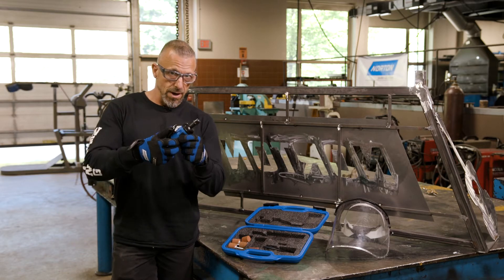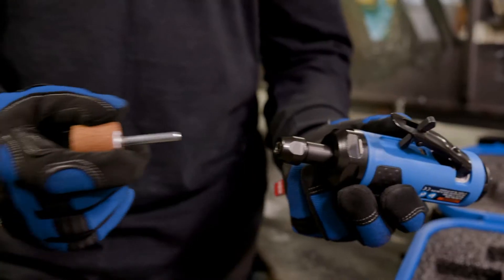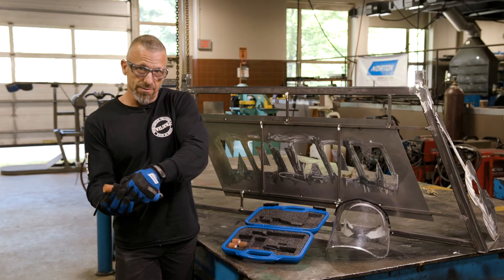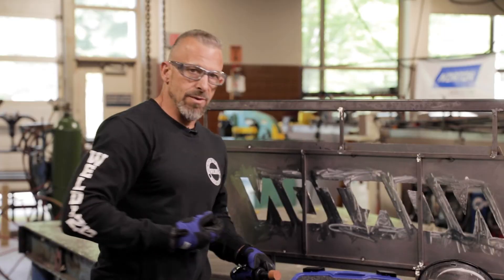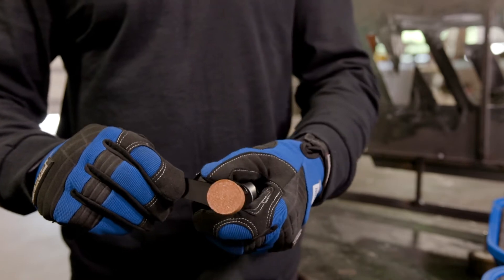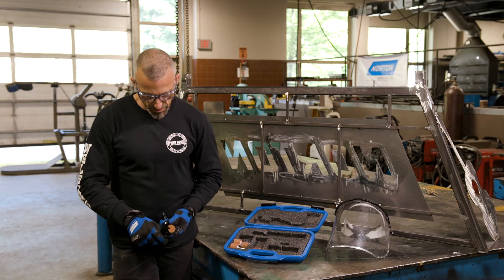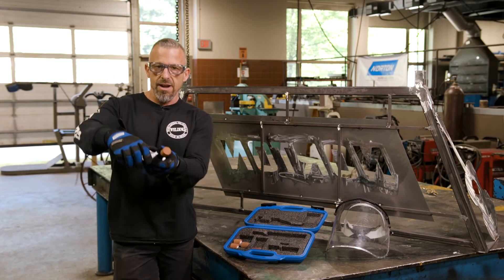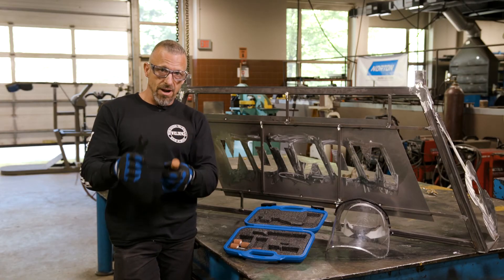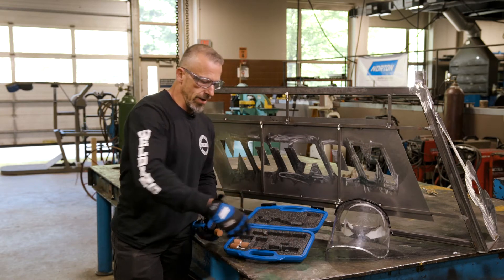Put the air chuck on and your tool is ready to go. Then you're going to add an attachment — here we have a mounted point — and slide that right into the front of the die grinder. I like to tighten these up by hand first. Then I grab the smaller wrench, which goes closer to the die grinder, and the bigger one goes around the nut at the top. I get them close together for a scissor motion — just pull up on it quickly. It's just a little trick: squeeze that and you'll be all set.